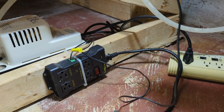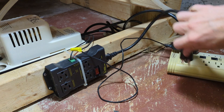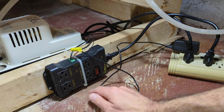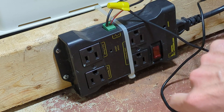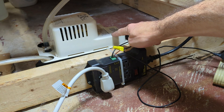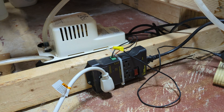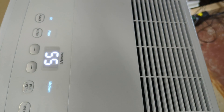Finally, plug in your DC adapter and plug in the relay. Here's the wire for the dehumidifier — I'm going to plug that into the normally on position on the relay. On your relay you have some other options as well: these ones for normally off, and this one is always on. So the dehumidifier is going to be normally on, and when that high water level switch in the condensate pump triggers, it will turn off the dehumidifier. But otherwise it will be normally on. It'll turn on power for the relay. And here's my dehumidifier — it beeped when I turned that switch on.